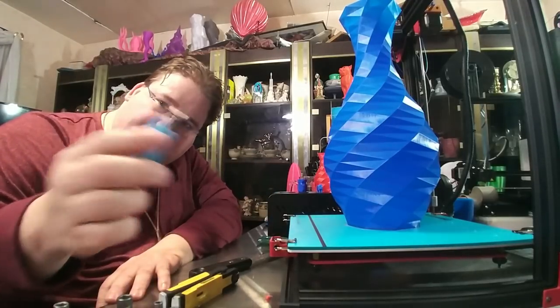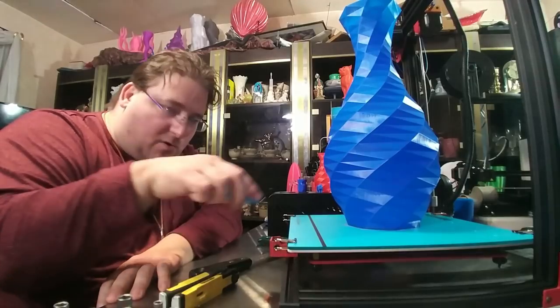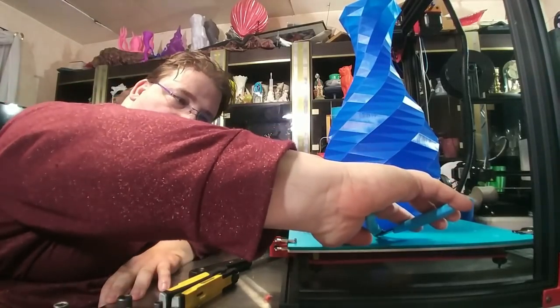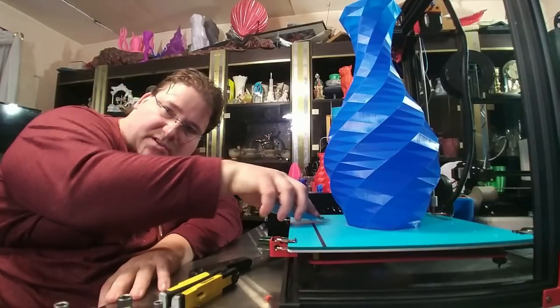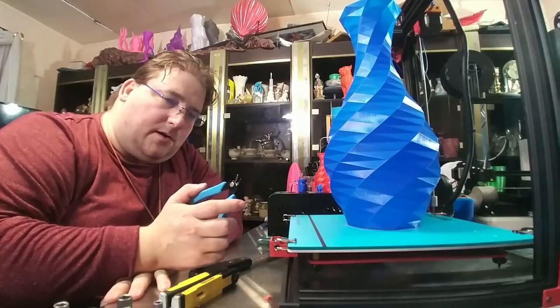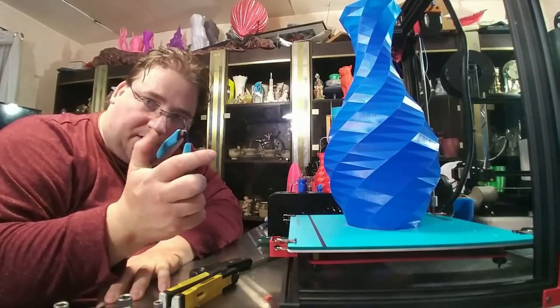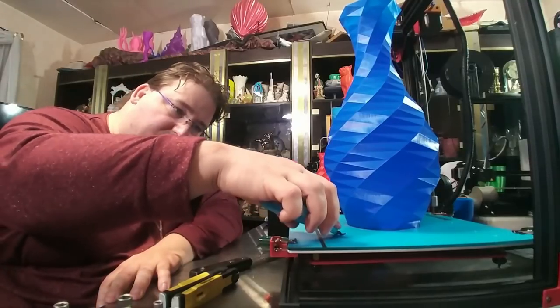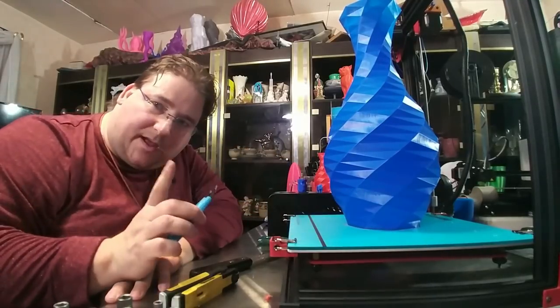Now these are thick, so you don't want to keep going because unless the part is strong, you might bend the part and damage it. Then you go to another corner and do a little snick. Another corner, do a little snick, and the part will pop off after one, two, or three snicks. If you're worried about damaging the part, you might not want to use these, but they're very, very handy for that. And as long as you keep these flush nippers flat, they won't damage your bed.